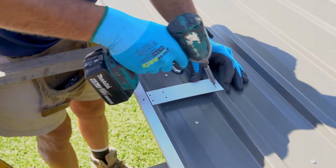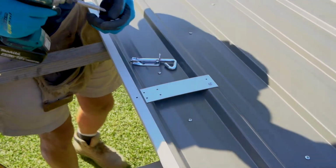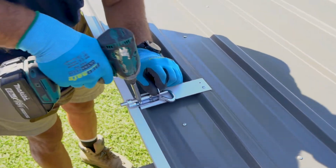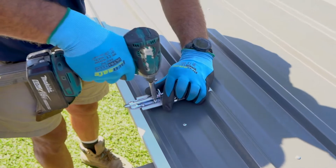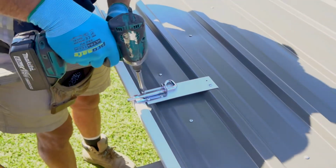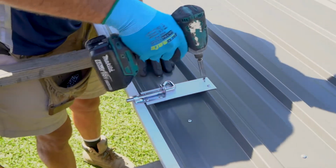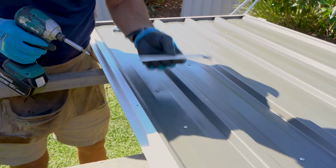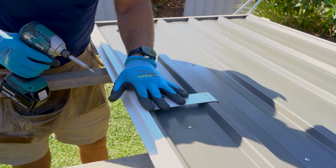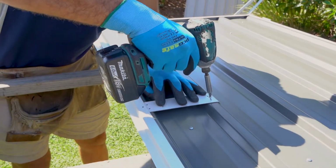Do the same with the other single door. Okay, line up that plate, 1 screw in, just to hold it in position. And then the last one in the plate. Okay, now we need to put our door plate on our double door. Now it has no pad bolt on this part. Pad bolts go top and bottom, so we can just place that over and screw that off.